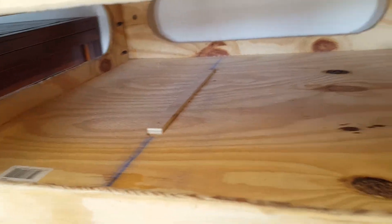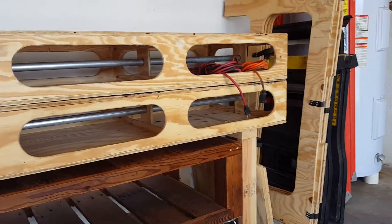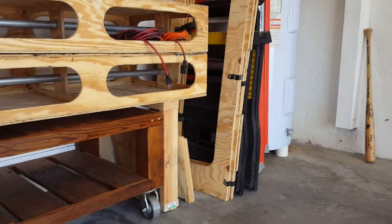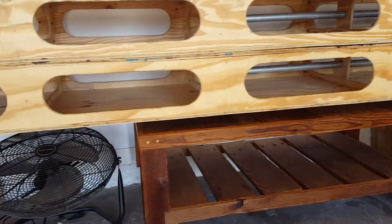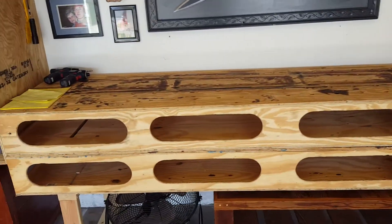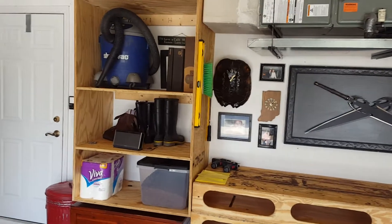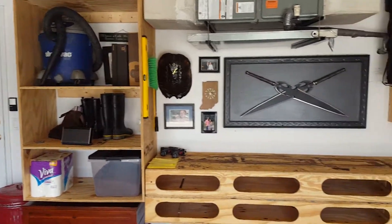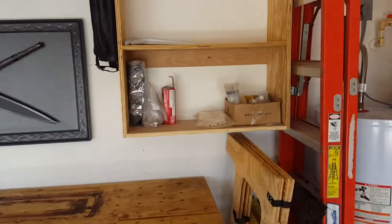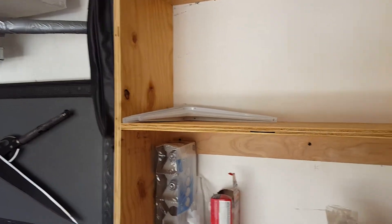I put this little nub down, air nailed it, and went off the same length measurements you'd use for the sawhorses. It turned out great, it's very strong. I built them 20 inches high so when they're stacked up it's 36 inches, same as before. I went ahead and built some two-foot deep shelves, and also built 12-inch shelves because some of it's over my workbench. I used three-quarter inch plywood and pocket holes throughout.